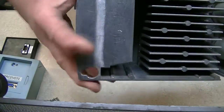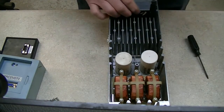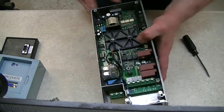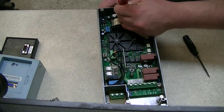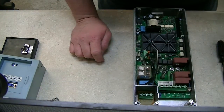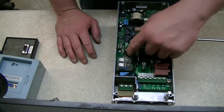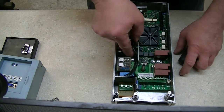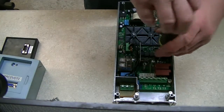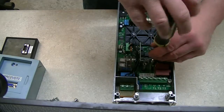There are two more clips down inside here, and then you have to pull that fan out before you can get the circuit board up out of here. You can do it without doing that, but it's pretty difficult and it could end up possibly damaging something. These four screws here are for the bus capacitors. I know these are discharged because this hasn't been powered up in over a month, but you always want to make sure those bus capacitors are discharged — otherwise you'll be in for one heck of a nasty surprise. They do hold a charge a lot longer than you think.